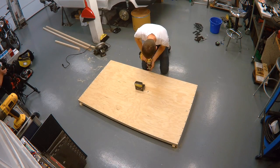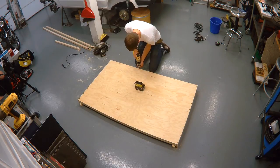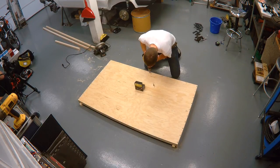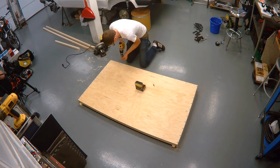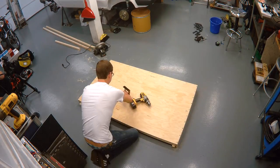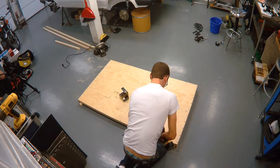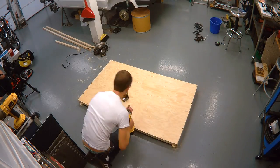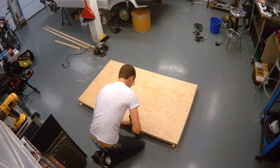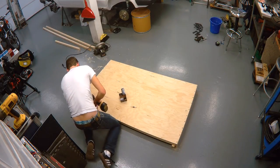If I really cared about this — if it was made of metal — I would mark my hole spacing on here, but I have a weird way that I do this. I start by roughly gauging where the center is between the two points I'm spanning screws, split it in half, then split that in half again, and continue to drill halfway between all my holes until I have a spacing that roughly looks right. That's my method because if you start at one end and pick an arbitrary spacing and work your way across, chances are you're going to get to the other end and it's going to look wonky.